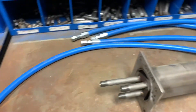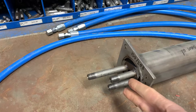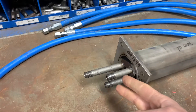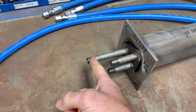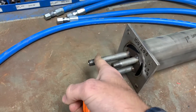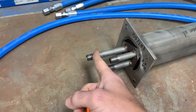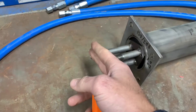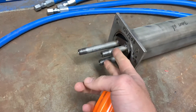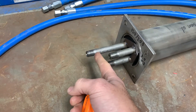The two shorter lengths are your low fire nozzles and the longer length is the high fire nozzle. The high fire is always larger in size — it could be threes on the lows and a six on the high, or three and a half and five. No matter what, your lows are always lower in orifice size than your high.